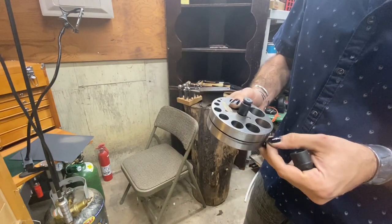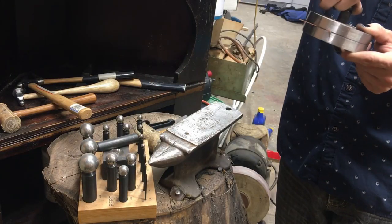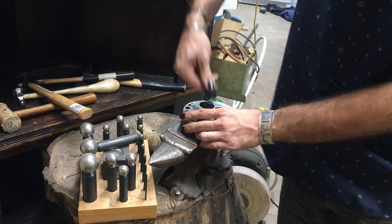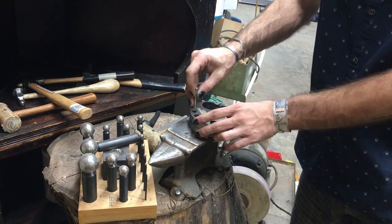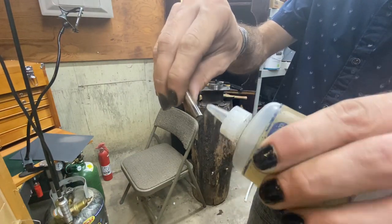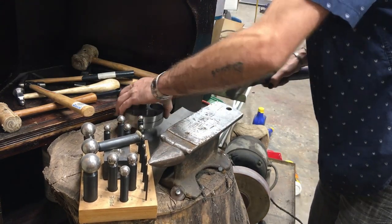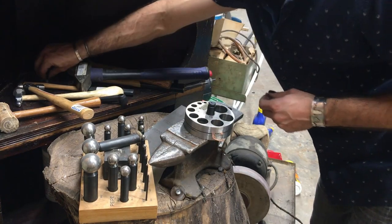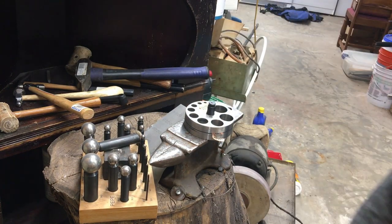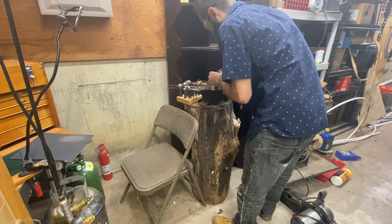You need to have, wherever you're cutting your disks out, a piece of metal the same thickness opposite where you're working so that your jig does not get out of whack. Do not cut metal over metal - you will mess up your punches. Always, always use cutting oil, some sort of lubricant, because these fit very tightly. Tap, tap, tap - one, two, three. Get it through there. Depending on how much bounce whatever you're hitting on has, sometimes I'll put a thin plank of board on the concrete and it'll cut it in one hit. With confidence.